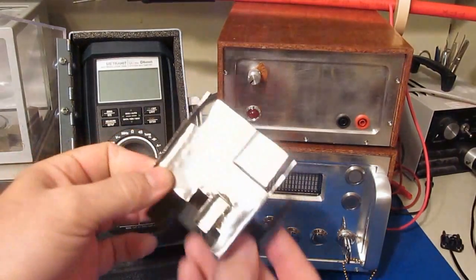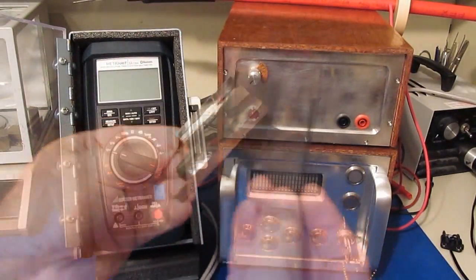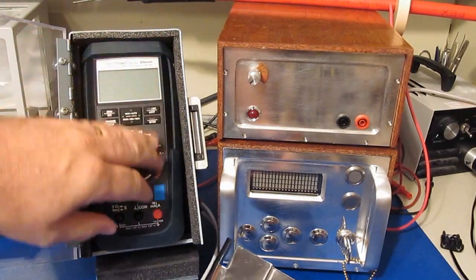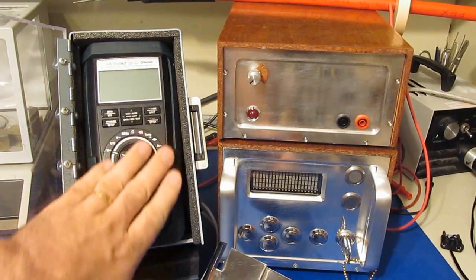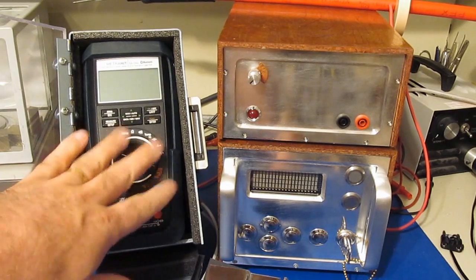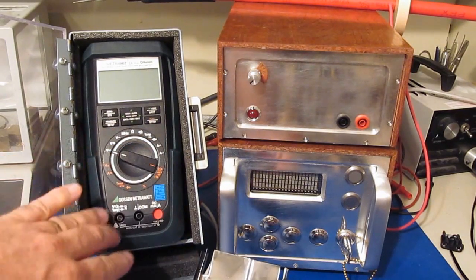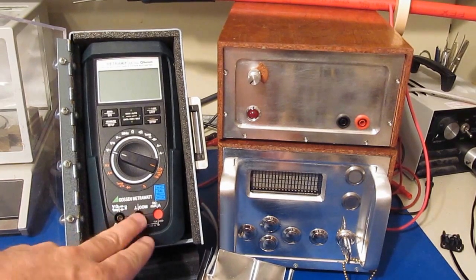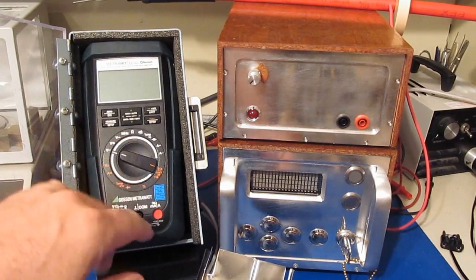In the previous video I showed where I made this shield out of mu-metal. This really helped this meter as far as holding the static charge cloth next to it or placing my hand next to it. It also helped with our relay sensitivity to the magnetic strap, which can cause the meter to change states where it will actually read a lower AC voltage on the input than what could actually be present.